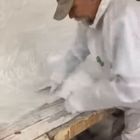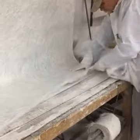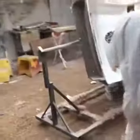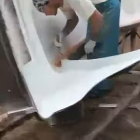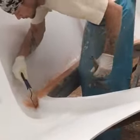I take my strips and get them wet, then go ahead and roll them in real good. Whenever you're doing fiberglass, air is the enemy — you've got to get all that air rolled out. You can see he's got little rollers with ridges in them, and as he rolls it, he's rolling the air out.